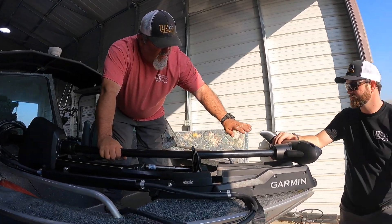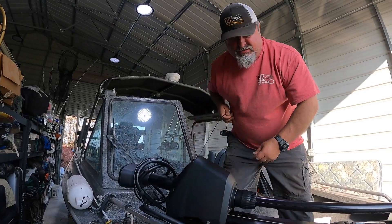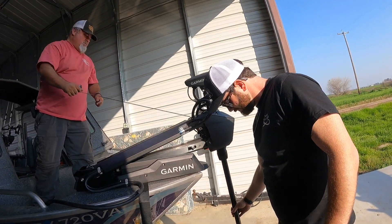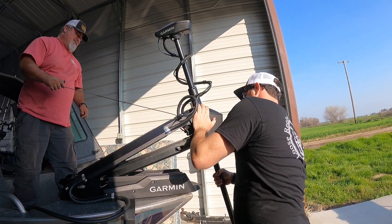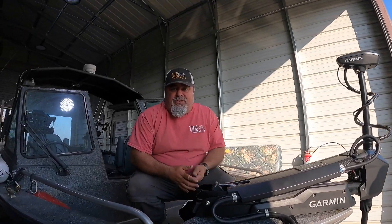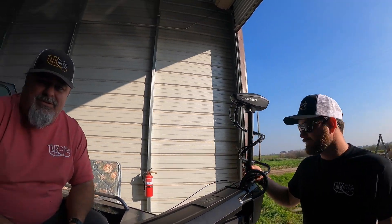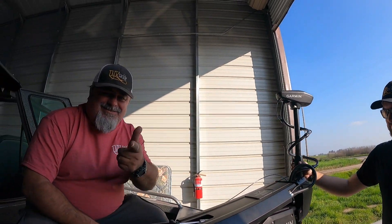This part of the installation is done. The prop is installed with about six to ten pounds of pressure on it and the motor should come up and down easily. That concludes this video. We're going to do another full video on how to run the power — you can check out how we set up the batteries and all the accessories that go between the motor and the battery system. Thank you for watching, and thanks to our friend Travis for helping. Until next time, we'll be back to you on the water.